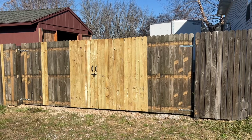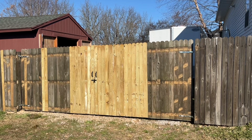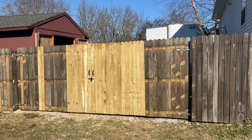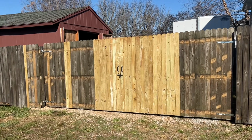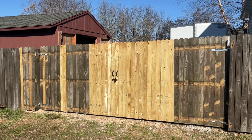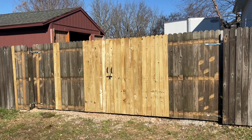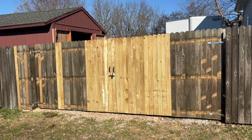Well, here we are. As you can see, I got the gate finished up. I used some of the old wood, kind of spotty. I hit it with a power washer and gave it another good coat of used diesel oil, my favorite hack. If you haven't heard of that, next time you're buying treatment oils, coatings, stains or preservatives for your gates, fences and wood products, look at the ingredients on the can. Some of them are waterborne nowadays. Some are just old-fashioned oil-borne, like linseed oil. What is it? It's oil. You can get diesel oil for free.